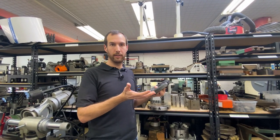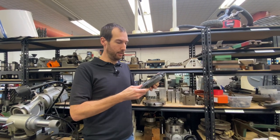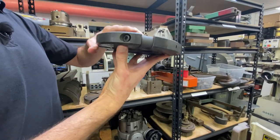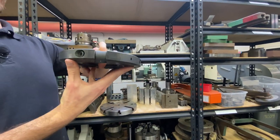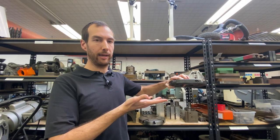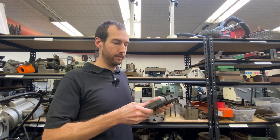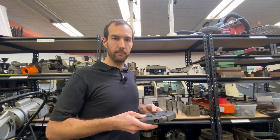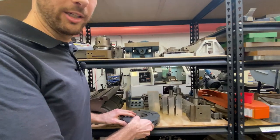There's always new stuff in the machining world to discover. I had actually designed one of these face mills several years ago and never made it because I couldn't find someone who had made something you could buy, or it was crazy expensive. I picked this one up for 20 bucks at a sale. What I'm thinking for this is making custom profile inserts to use for machining special textures and patterns on surfaces of metal. It's a great example of how the different types of tooling, fixtures, shapes of cutters, and processes in the metalworking world are pretty much endless.